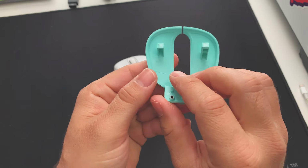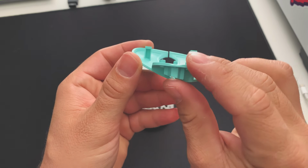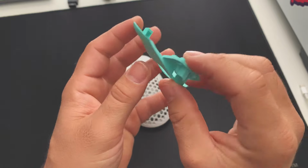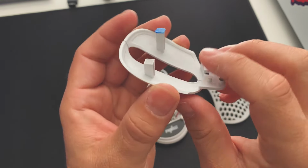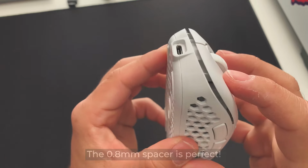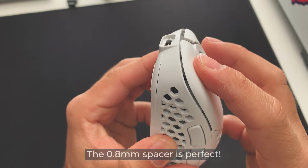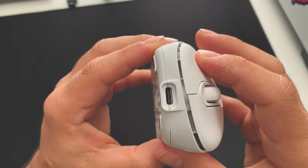Turns out that the issue I was having was due to the left leg being ever so slightly shorter than the right leg. This is what caused the sensation I mentioned earlier. The solution was to cut out and layer 2 small pieces of painter's tape to go underneath the leg. This essentially canceled the pre-travel, and the post-travel has been drastically reduced or even canceled depending on where you press the button. Both clicks are now consistent with each other and they feel great. I'm not sure how long this will last, but so far it's been working beautifully, and it's a simple enough fix to where I can redo it if I need it.